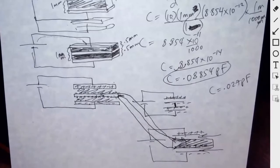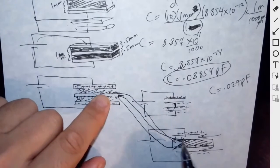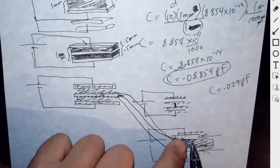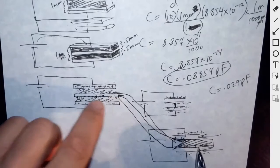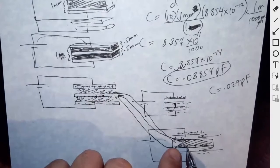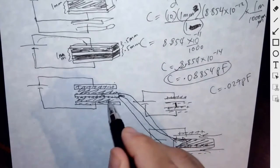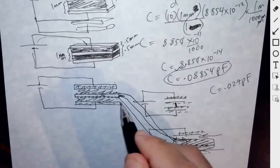Wow, that's amazing. So that one plate has different or opposite charges on either side of it? Yeah. On the top of this plate, you will already have a negative charge, and that will act like the bottom of that capacitor. And the bottom of that plate, you will induce a positive, and that will act like the top of that plate. You see? And now I can keep multiplying. I can put another plate, another plate, another plate.